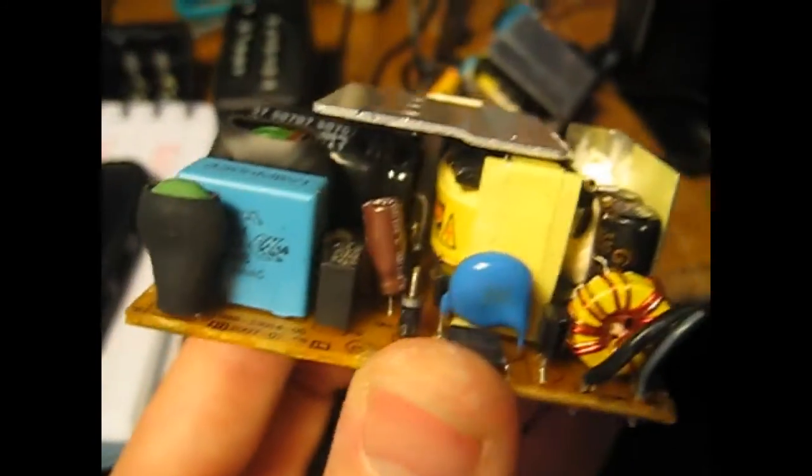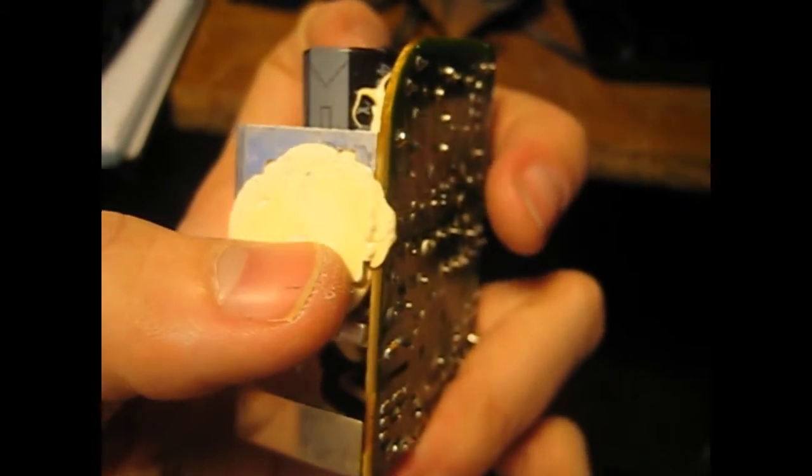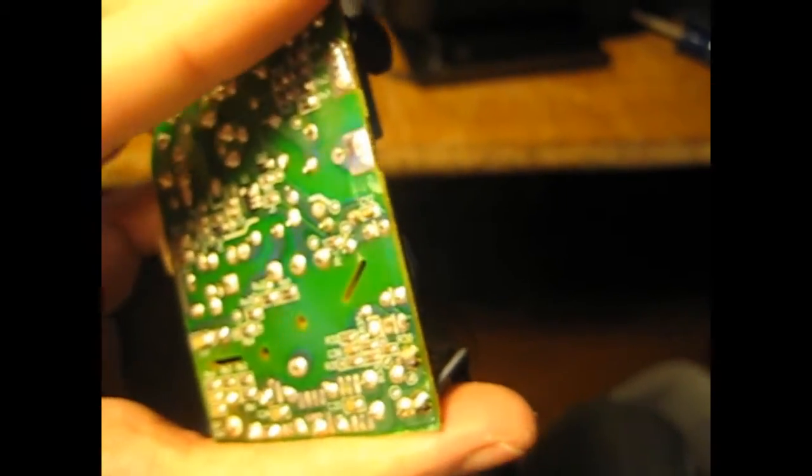Here is the other one — the first one — and they are popped on that one too. These are actually a little leaky, or previously leaky. That's the problem. Pro tip: there's rubber glue on the back that I forgot about. The first one was pretty easy to pop out, but the second was a pain. That glue holds it into one half of the case, so it might not be as easy as you think to pull it out once you've cut it open. I had to use pliers and grab very carefully where there's no circuit and just pull hard.